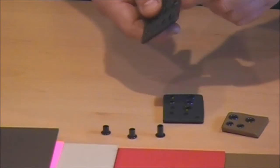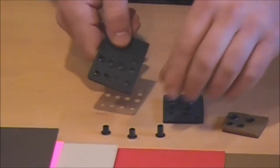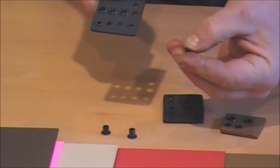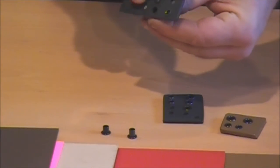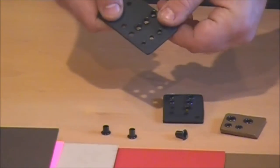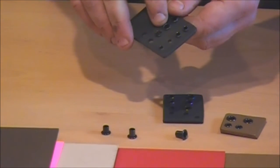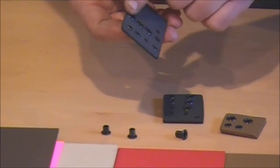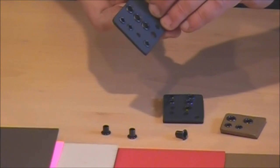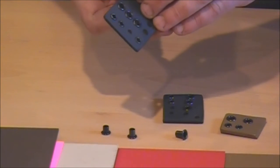the other reason I've looked at the thicker rivets is because you actually get a face to these. The face that's already turned is the good face, and the face that you form doesn't give you quite as nice a look. So in general, although most sheaths are designed to be ambidextrous by simply bolting them around, I try and put the good face on what I consider is going to be the one that's mostly used for show. In general it's right-handed, but if I know somebody's left-handed, I'll turn the rivets round.